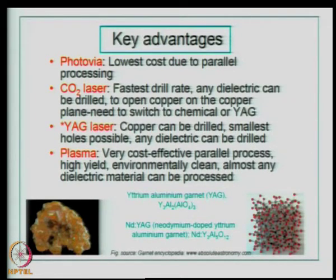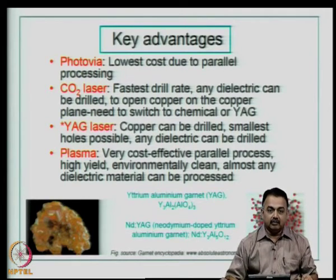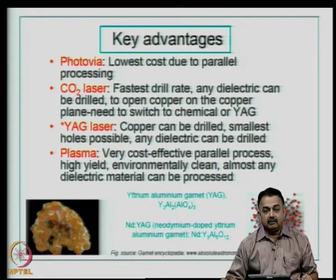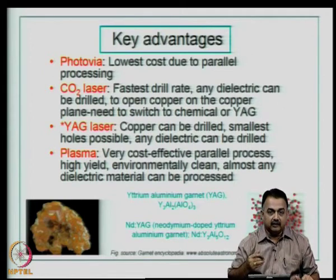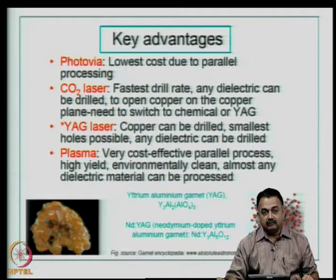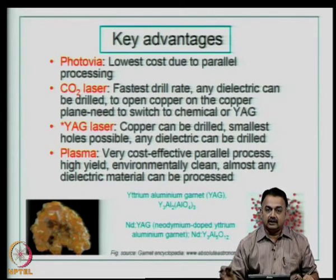One method is the mechanical drill. The limitations of mechanical drilling today are around 150 microns, though some equipment can drill 125 microns but can be expensive. Beyond cost, if you use such small mechanical drills, the next issue is how well you can wet the hole barrel and the inside of the dielectric to make it conductive. As size decreases and aspect ratio increases, you will have difficulties in electroless plating.